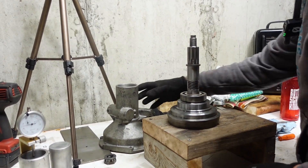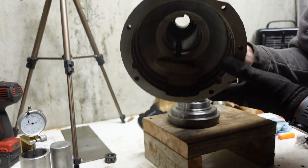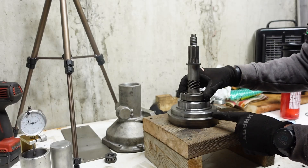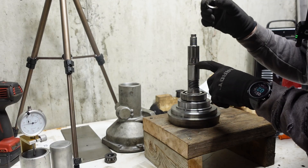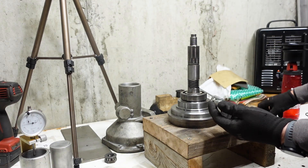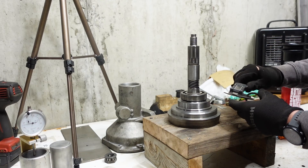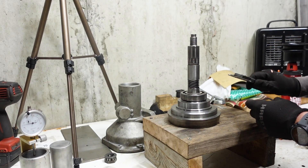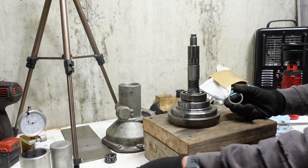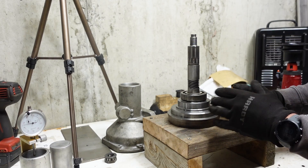There is the annulus released from the housing. The housing is just an empty housing now, except that bearing is still in there — I'll be able to pop that out. You've got the larger bearing down here, and that right here is the spacer. There's a little ledge there that it rests on. I'm going to measure this spacer — it was original to the transmission — and it looks like about 154 to 155 thousandths. With new bearings, I'm going to reuse this and see if I don't have to worry about a different spacer. I do have a handful of other spacers from Rimmer Brothers — a couple larger, a couple smaller — that will hopefully adjust the end float if needed.